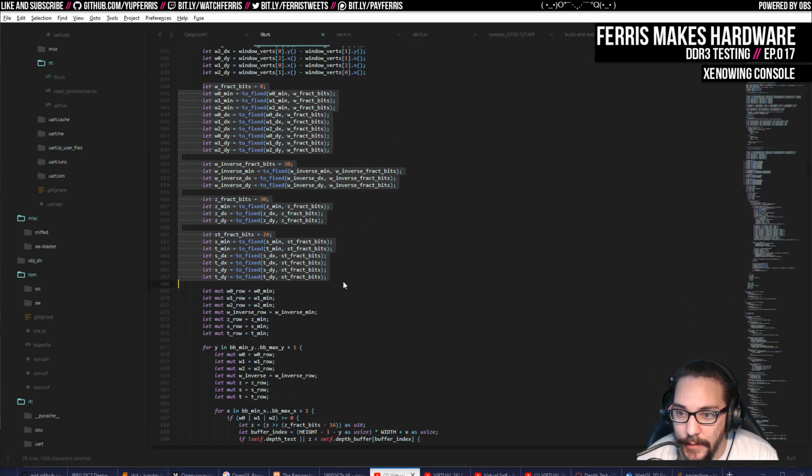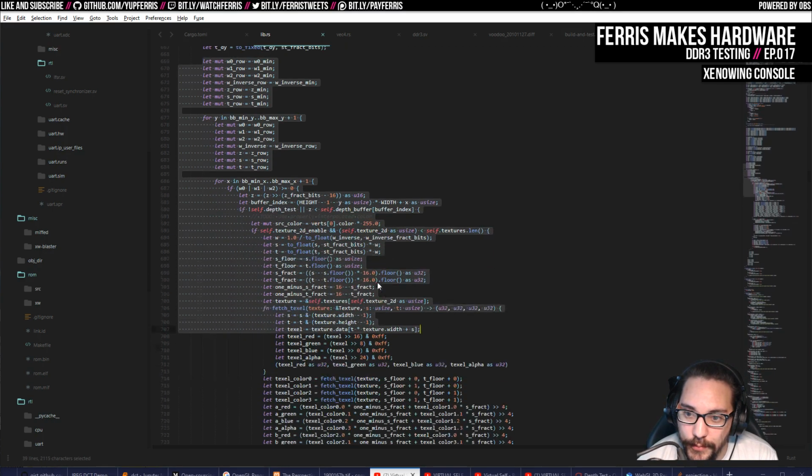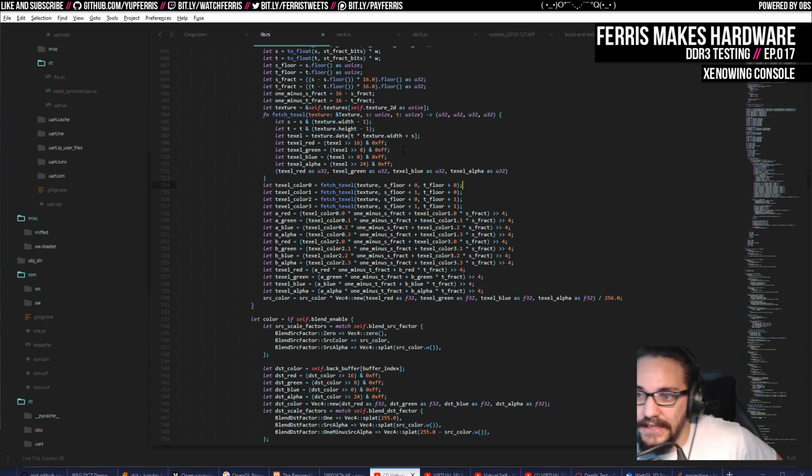because what I'm thinking is that pretty soon, once this whole inner loop part, which is the actual rasterizer itself, is all fixed point, then I can start separating that in software a bit more, isolating that, and then start moving that over to RTL. And I might even replace the software implementation with a Verilator simulator, but I need to consider a few things before I try that.